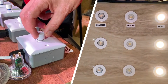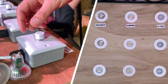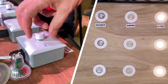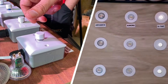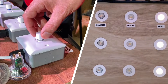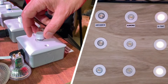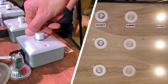Let's check the low end first. It's not low enough, so we're going to have to make some adjustments. We switch the dimmer on and turn it down to the minimum level, switch it off, switch it back on, turn it up to maximum, switch it off, switch it back on — the dimmer gives a little flash to say it's in programming mode. Then we dial down to our low end setting, get somewhere nearly where we're acceptable, tweak it, switch off and switch on again. The lamp has memorized that setting and gives a little flash to confirm.